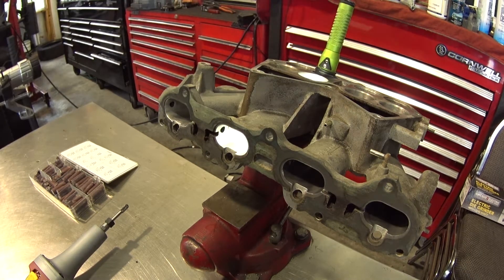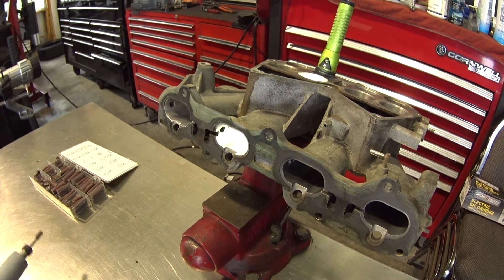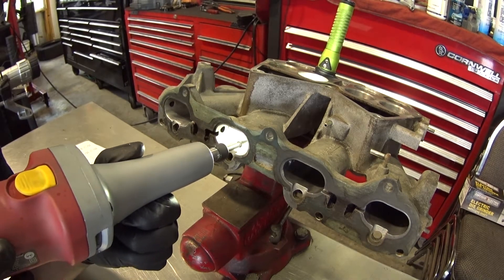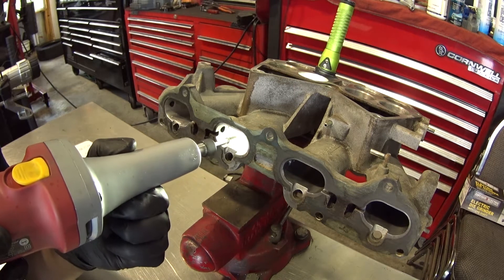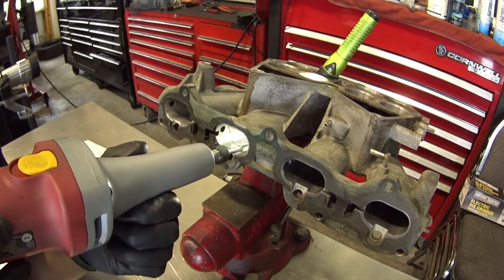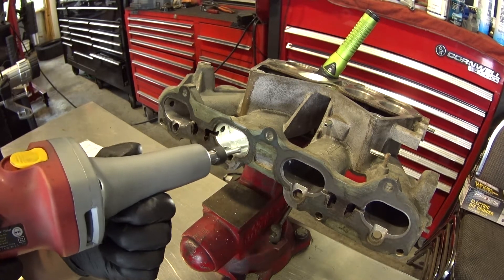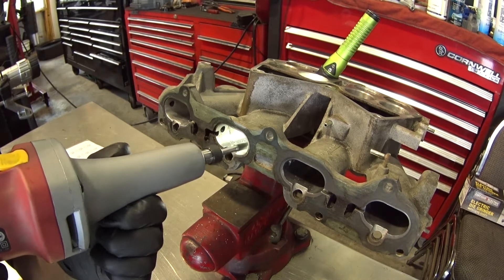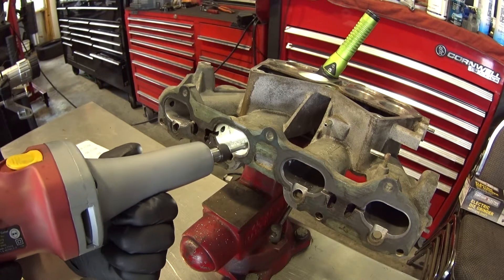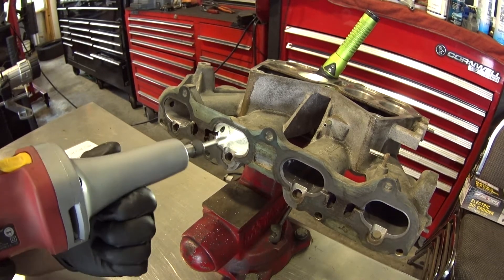I'm not really that new at porting aluminum parts. In the past, I've ported some single overhead cam VW heads and intakes and had some pretty good results. I'll also note that if you're going to be porting parts like these, do not use a single speed electric die grinder such as this one. I'm sure it's good at a few things, but not porting. In order to get good clean porting and polishing techniques, you'll need to use a pneumatic tool with a progressive trigger or an electric tool with controllable speed settings. This way, it's easier to control how fast or deep the tool is cutting or polishing.